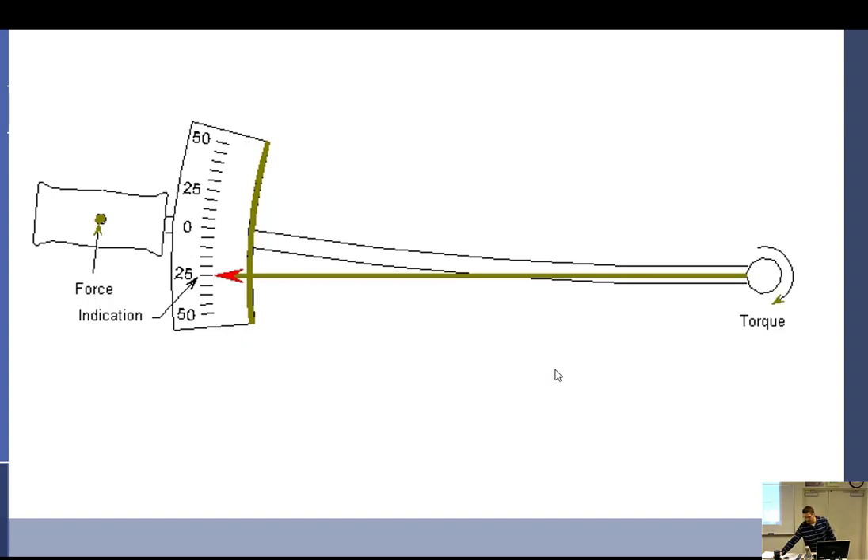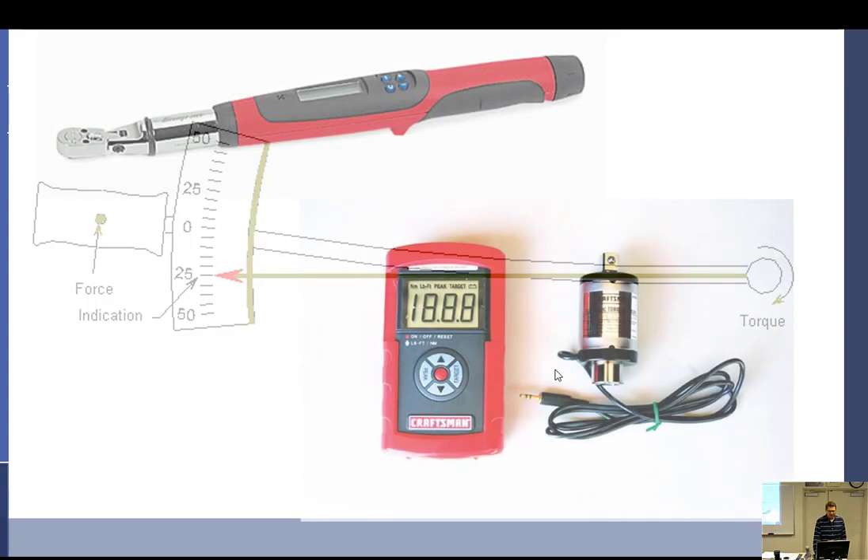When we get into cylinders, you'll be using cylinder-based wrenches which have a funny curve. You can add a tremendous amount of torque and not even notice. I'll have you guys practice — I'll say go up to 300 inch pounds your way, and I'll look and say you're at 600. You think you're at 300, but you doubled it by the way you hold the wrench. There's definitely a way you have to hold it.